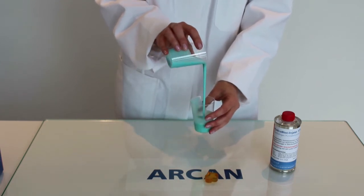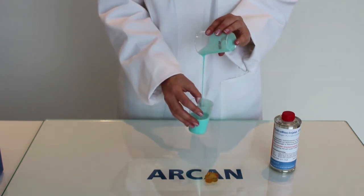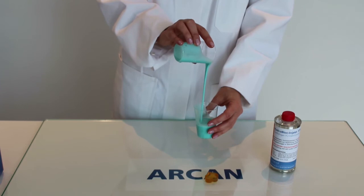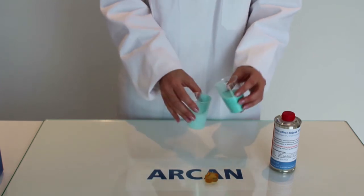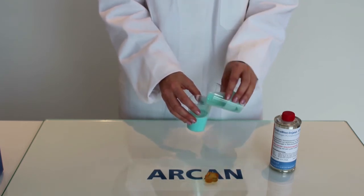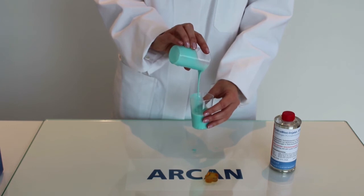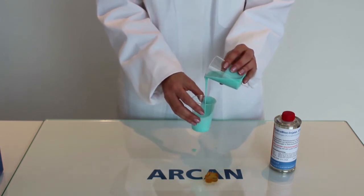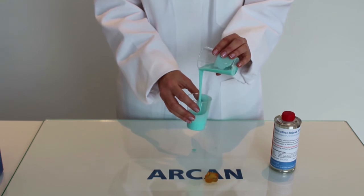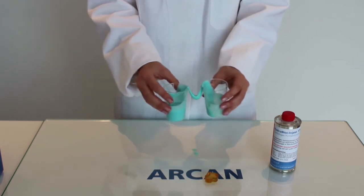HydroBlock 575 Integral doesn't require the inconvenient mixing of A and B components or the addition of smelly accelerators. Work can be started at once after lifting the cap of the bottle. One of the typical problems with two-component resins is the extremely short setting time in high temperature surroundings — this problem doesn't apply to the Integral systems, because they are unaffected by temperature. Only the available humidity defines the length of the curing process. The viscosity rises until the peak level is reached and the end product, a highly elastic rubber, arises.